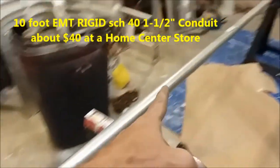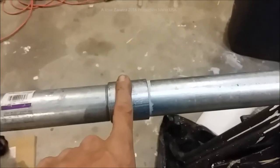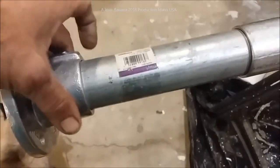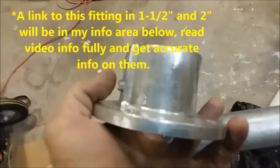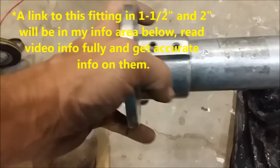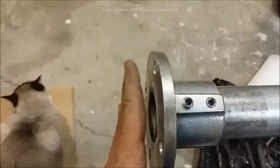This is the one big thing — I've pre-drilled it to make the video a little quicker. I've got a short piece and a 10-foot piece of schedule 40 EMT — this is the heavy schedule 40 EMT electrical conduit with a regular coupling on it. The 10-inch piece already has been drilled and I've set it up where I dimpled where these set screws are going to go. This is aluminum, very heavy gauge — I think it's about 5/16 thickness — and it has the set screws on it.